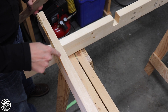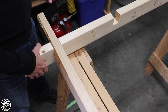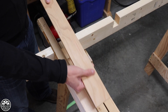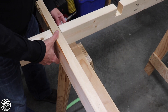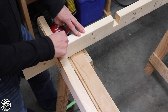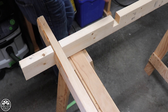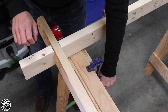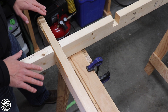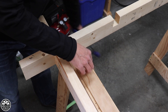I'm just doing one end at a time. I've got the end pieces in, and I've got this piece of quarter-inch trim made of fir that's going to slide under here. Effectively what I'm going to do is make some clamping shoes for the frame so that these can swing out. I'll be able to throw a clamp on here at the bottom and keep everything in place. That will just keep the frame from shifting when I've got things on top of it — I don't want the whole frame sliding off the saw horses — so this quick clamp scenario is the best way to do it.